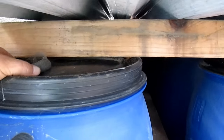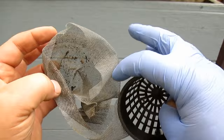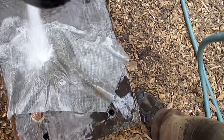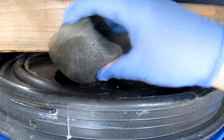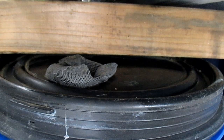The next tip is to make sure the debris filter on your rain barrel system is nice and clean as well. Mine is very clean because I do all of that maintenance and cleaning beforehand, but I'm just going to give it a quick spritz of water and clean out the screen. You can use a mesh screen or an old piece of hosiery. The main thing is that whatever mesh material you use, you want the holes to be small enough to not allow any critters in — especially mosquitoes, as that could be a real problem.